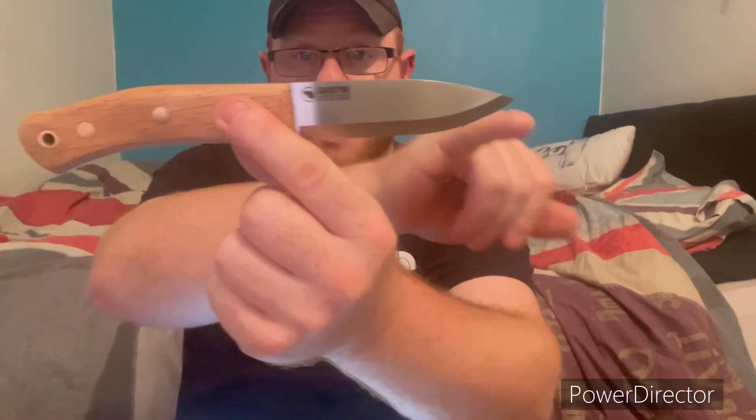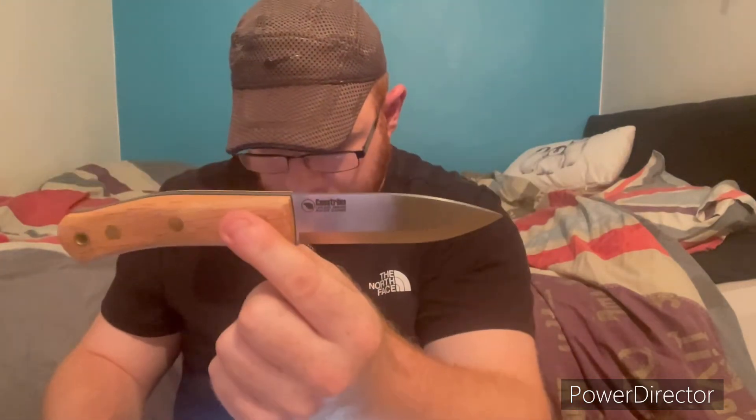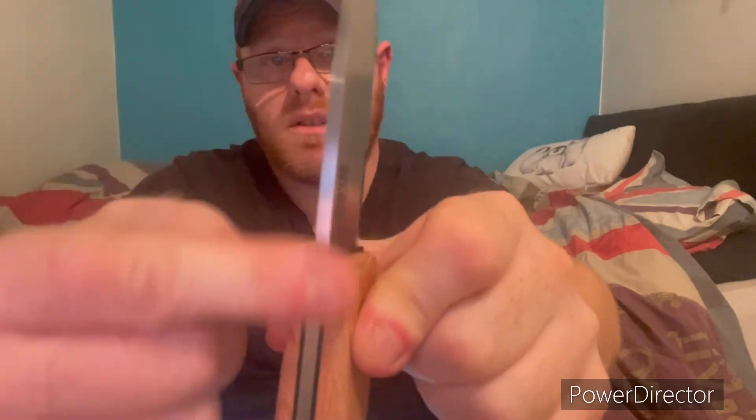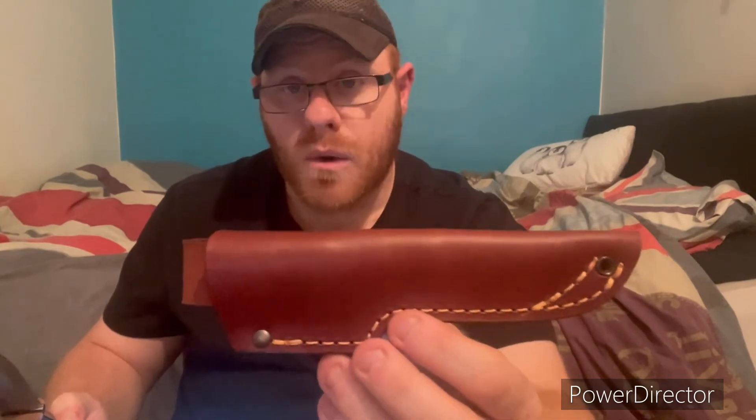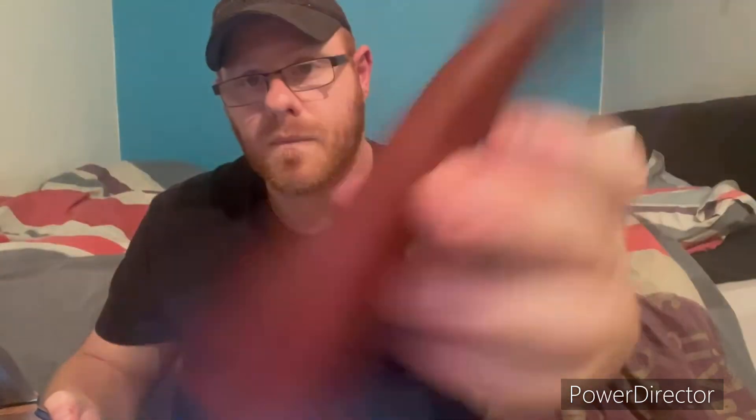The handle is oiled oak from sustainable forestry, with black liners and brass hardware. The total measurement is 22 centimeters — that'll be from the tip to the butt of the knife. The blade is 103 by 24 by 4 millimeters, so the 4 millimeters would be the thickness of the spine. The sheath is vegetable tanned European leather, cognac brown. The steel is Uddeholm Sleipner non-stainless, 59-60 HRC.